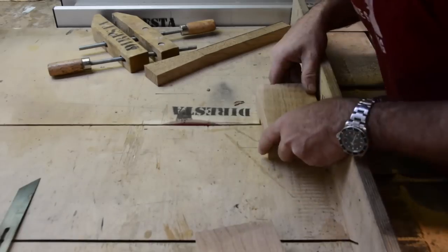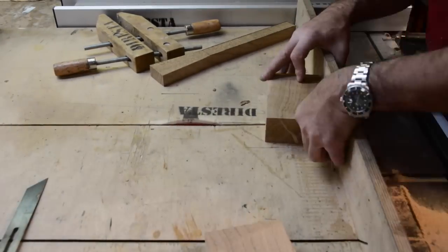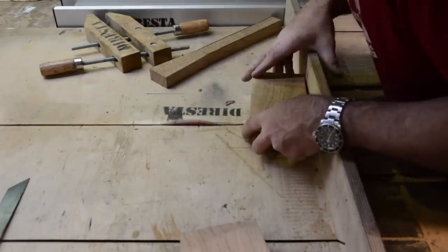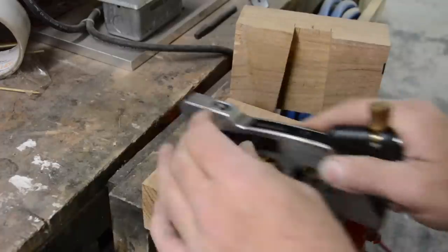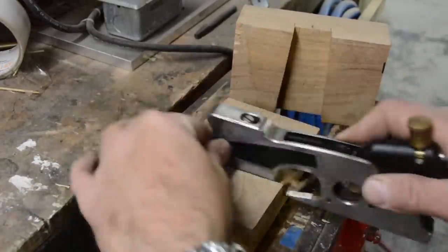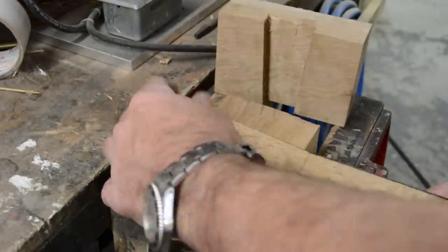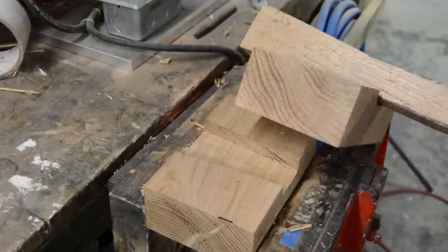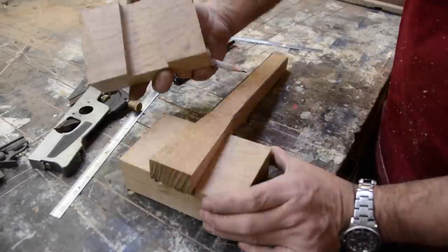Just by having a chunk of wood kick it up, it gives me the few-degree angle that I need. I don't even know exactly what that angle is - I kind of freestyled it. I just want to make sure the tapers are the same so that the mallet handle fits into the head. Now I'm using my Veritas shoulder plane to clean out the saw marks and make it nice and flat, and it kind of fit together one way perfectly - that's why I'm flip-flopping everything around.